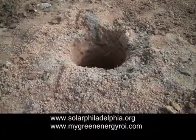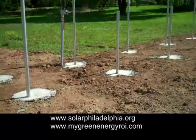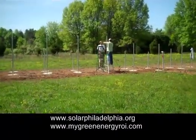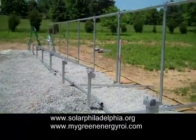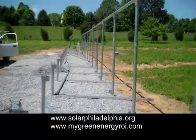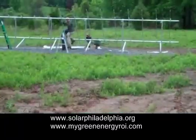And now a short video on constructing the solar array. There are the footings — the holes dug. There are the footings filled in with concrete with the vertical poles, and there are the lads trimming the poles off to get the angle correct for the solar array. The verticals and horizontals are up, giving a 41 degree tilt. The diagonals are going in, and he's finishing off the diagonals, and the construct is there.